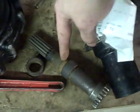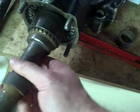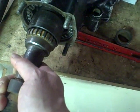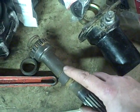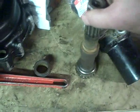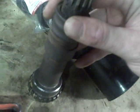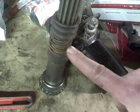But I don't believe the spring goes here — I believe it actually goes here, with the other end sitting inside here like that, basically creating a situation like this. I'm not sure exactly what the purpose of that would be; maybe it's like an anti-rattle spring. And I don't think this collar actually belongs on here at all. The reason why I believe all this is because if you put this back together the way it was, you've got to pretty much fully collapse that spring, which makes the spring pointless, even to get this collar and bearing anywhere near where it should be.